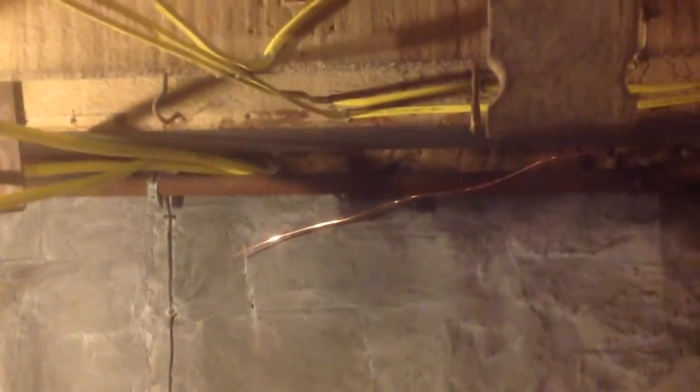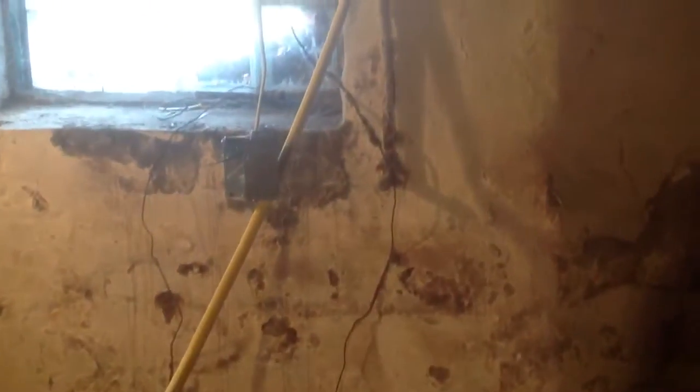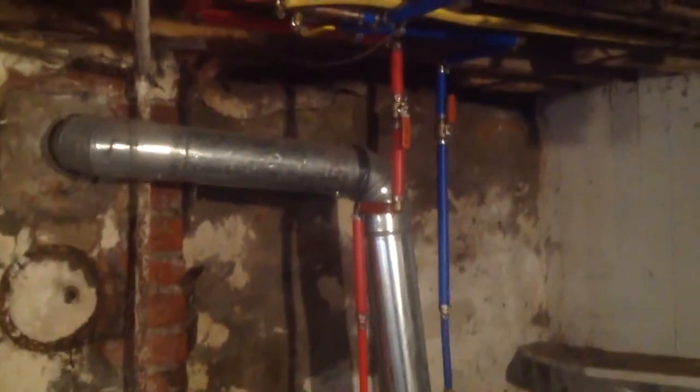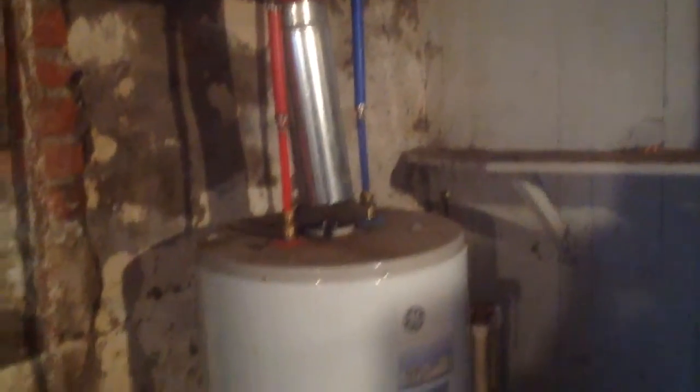You can see we have our ground wire already running out. We have the line for the dryer in, and I'm going to run that down a piece of wood, so I'm okay with running it like that — it's not hanging in mid air. The hot water tank we're going to run black iron from the tank up to the ceiling, just so we don't have line running in mid air where someone can grab it and yank on it and pull it.